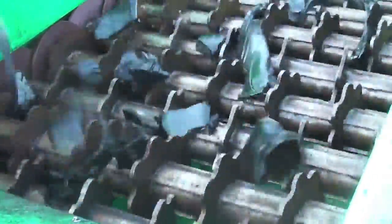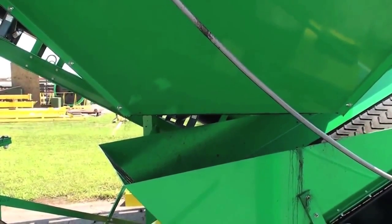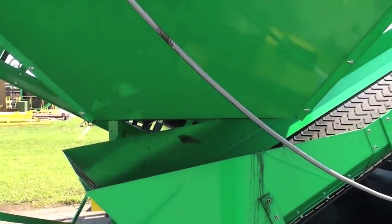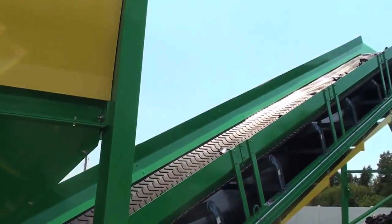After each cut through the shredder, the CM classifier is used to separate the oversized material from the properly sized chips, as seen in this demonstration. The larger pieces stay on top and the proper sized chips fall through, then are discharged from the bottom of the classifier and conveyed away. The material is now finished product and ready for resale or further processing.